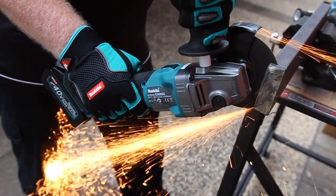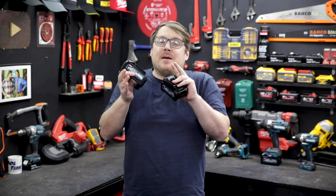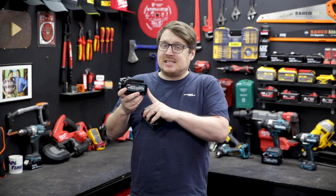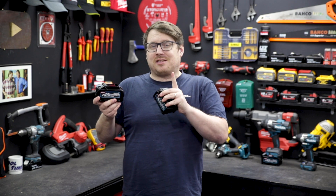So you can put the tool under more stress with less wastage, and effectively deliver a longer run time. When you're comparing batteries, you can't just compare side-by-side batteries with the same amperage. The cells inside are important, and the 21700 cells are absolute game-changers, with larger storage and less energy lost thermally.